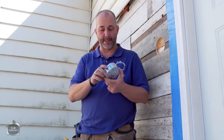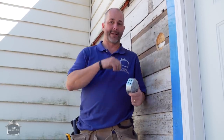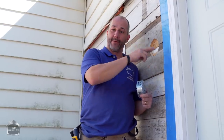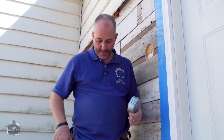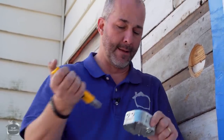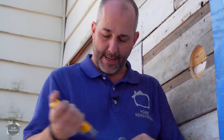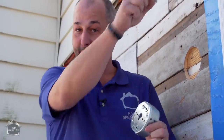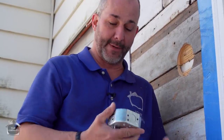The reason we need to use one of these boxes — and I can't just use a pan box — is because I'm putting a light on each side, so I have two wires coming out here. According to code, you can't put two wires into a pan box. On the other side I'm just putting a pan box — I'm going to run one wire right over there, surface mount that one, and it'll be great. But this one needs special consideration, which is why I'm demonstrating it.